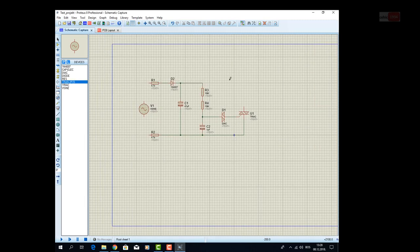After capacitor C2 is fully charged, the voltage across the DIAC rises and it conducts. This provides gate current to the triac. The triac fires and completes the circuit of the transformer.